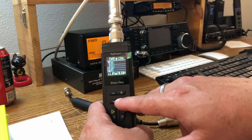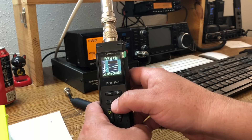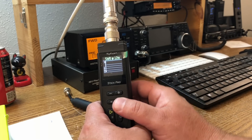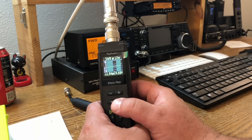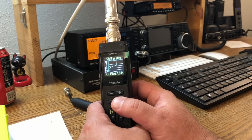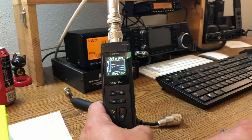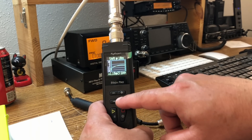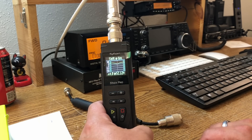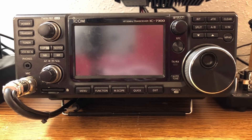17 meters is a little high - like 3.5 to 1. There's 15 - a little high again. I'm not going for perfection here and you'll understand why in a minute. I just want to get an antenna up in the air that I can use on all bands; I don't really care about losses. 10 meters is a little over 3 to 1 across the whole band except for the bottom. And 6 meters - not happy, 4.9 to 1 at 52 MHz.